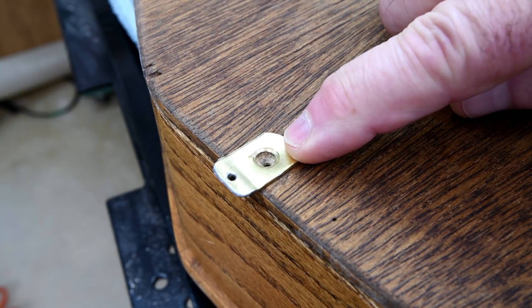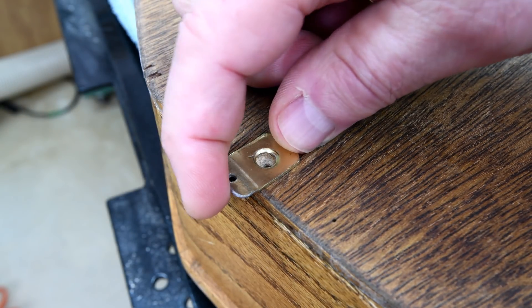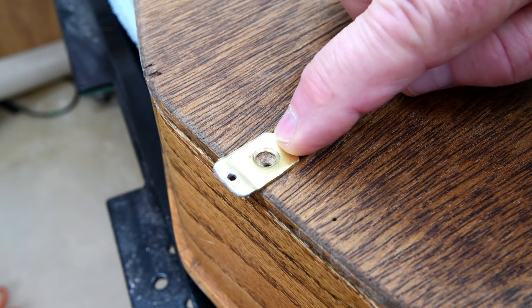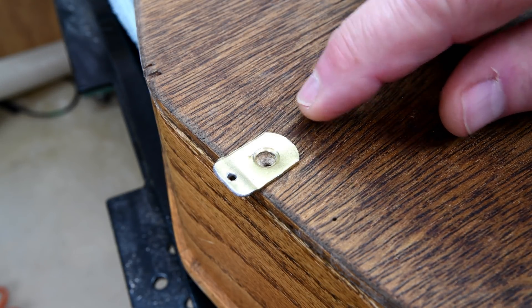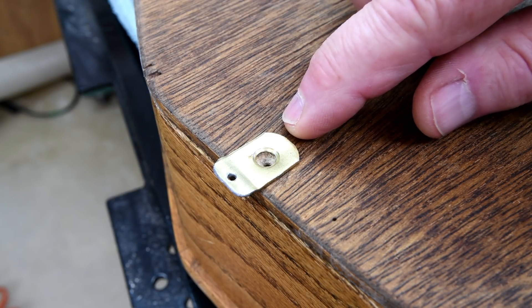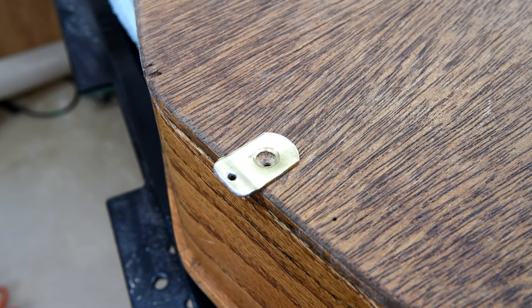You've probably noticed this thing on the bottom. I was going to try and pull it off, but I gave it quite a pull and it didn't want to come — I have a feeling I must have glued it on. The purpose of this was so that with the mechanical movement, in order to get the beat regulated just right, occasionally the clock had to be just slightly crooked on the wall. We'd put a nail in to hold it at that angle, because once it got bumped the clock would not work properly if it got off its best angle.